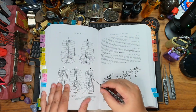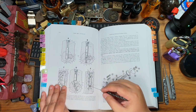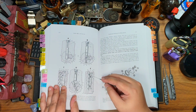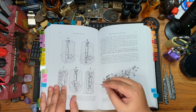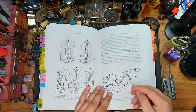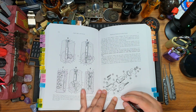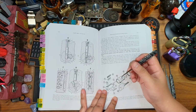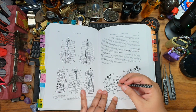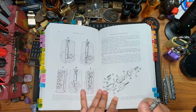And so here's a good representation of the sidebar when it engages with the key pins. This shows, I think, a key it's engaging with, but when it engages with the key pins, it's pretty much similar to that. The sidebar will fit right in those slots, and then you'll be able to open the lock. Because the way that works is the sidebar is this element here, and that actually has to get depressed into the key pins in order to fully open the lock. But I'll show that when I gut the lock.